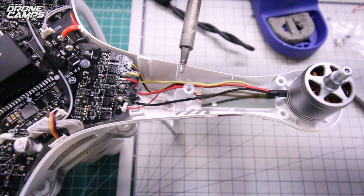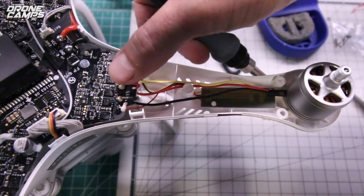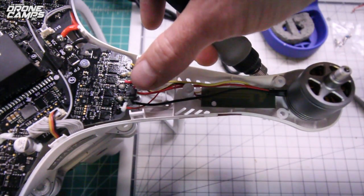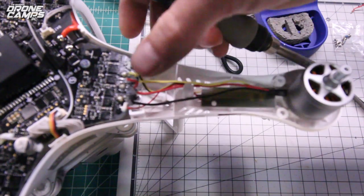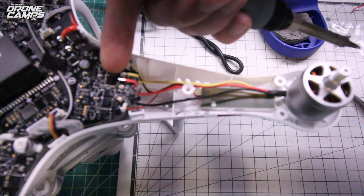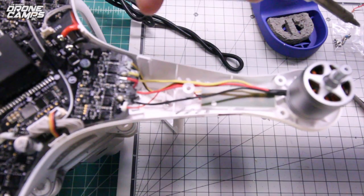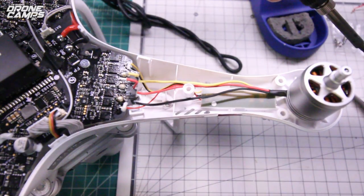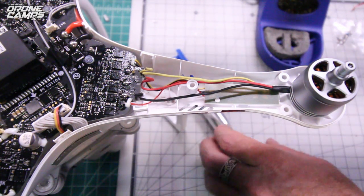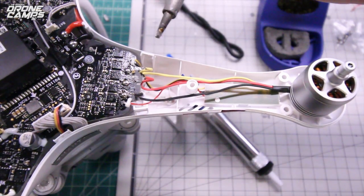Now I have my 3 wires running down under here, and I kind of tuck them under, and I sort of S-bent them, and I have them bent so that they're straight. When I solder this down, I want to make sure that it's nice and flush with the board. Also, you want to make sure that this wire is not too long and touching one of these chips out here, so that you want to make sure that it's perfectly inside the bead of solder and not touching other components on the board. So now you're to the point, you've got your iron hot, and you have your 60/40 rosin core solder over to the side here, ready for making your first attempt at soldering up this wire.